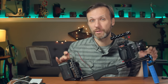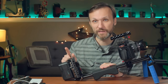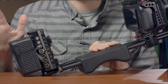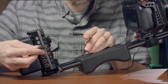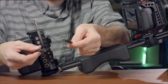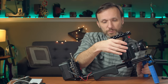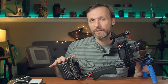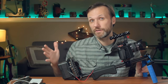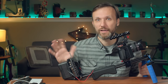If you're putting your camera on a bigger setup like a shoulder rig, the best option is a V-mount battery plate. I have one here from JTZ — it's a great plate with lots of options including a DC connection. Just take your DIY plug, plug it into the V-mount battery plate, and you can power the camera and shoot all day. How long? It depends on the size of the V-mount battery — the one I have is 98 watt-hours and you can get around six hours or more.